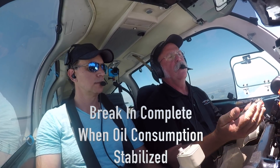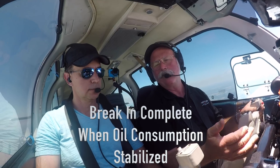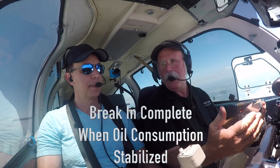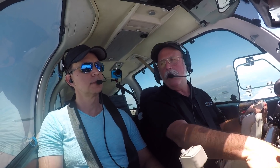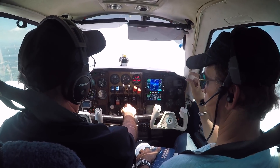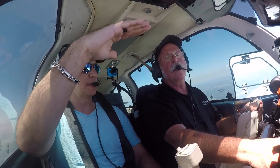The break-in is considered complete when the oil consumption has stabilized. That's not a definite hour number — I can't tell somebody ten hours, or eight hours, or six hours. If the oil consumption stabilizes and you've quit adding oil, your break-in is done. When you say quit adding oil, if you go down a quart you don't immediately add the quart; you let it drop a little bit to see if it's going to settle. Most of these will settle right around two quarts lower than whatever the maximum is, and that goes for almost all Continental engines — whether it's a 12-quart sump, a 10-quart sump, or some of the 8-quart sumps on certain Cirrus aircraft.